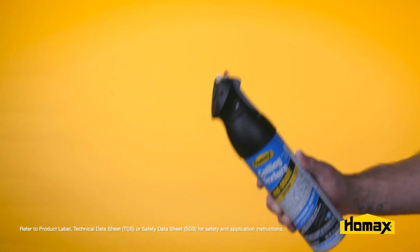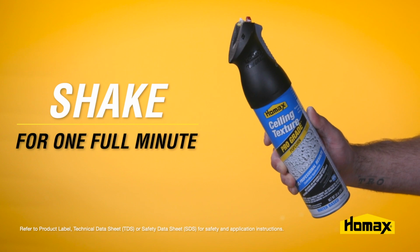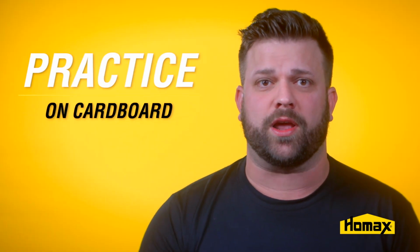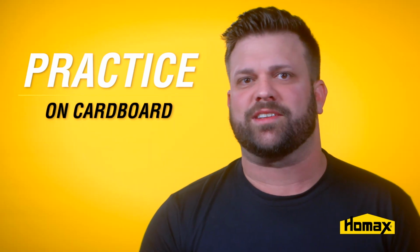Next, you want to prepare it to texture. You want to shake the can for 1 full minute after you hear that marble start to rattle. You may not hear that marble immediately, but it'll come. You can also practice spraying on a piece of cardboard to familiarize yourself with the product and to practice matching to your existing pattern. Now you're ready to retexture the area.